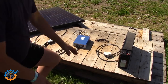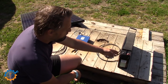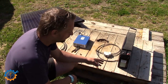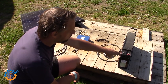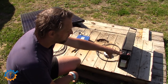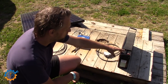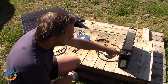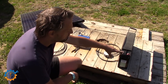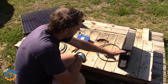First of all we start with the battery. In this example we will be using a lead acid battery. You can basically use any type of battery out there — anything from lead acid to lithium to nickel-cadmium or nickel-metal hydride. The most common ones today are lead acid or lithium-ion batteries that you see in DIY power wall systems. A lithium battery generally has a much higher energy density, so that means more energy per kilo. Lead acid will work just fine though. One thing that's really easy with lead acid is that you don't need to care much about balancing — it's generally about float and bulk charge.